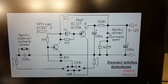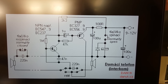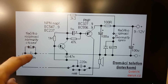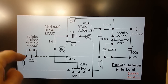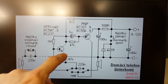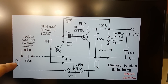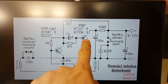This can run on a 9 volt battery in standby for a couple of years, and on a double-A it could run in standby for like two decades. When somebody wants to talk from this side, he presses the button — which opens the circuit because it's a normally closed button. The speaker coil resistance is very low, almost a short circuit for the small current through the one megaohm resistor. But when you press the button, the speaker is connected via a capacitor, which allows a DC bias for the base of the transistor. You can then speak into the speaker, it amplifies, and you can hear it from the other speaker connected via the relay to the output of the amplifier.